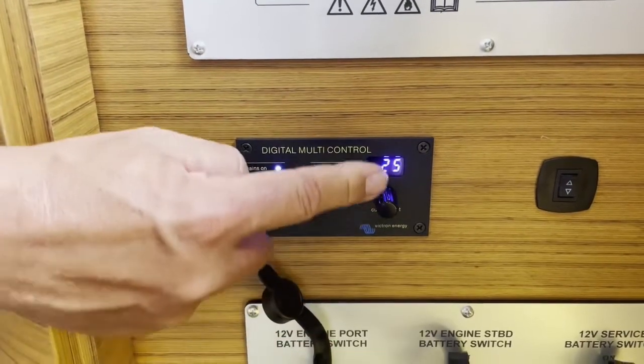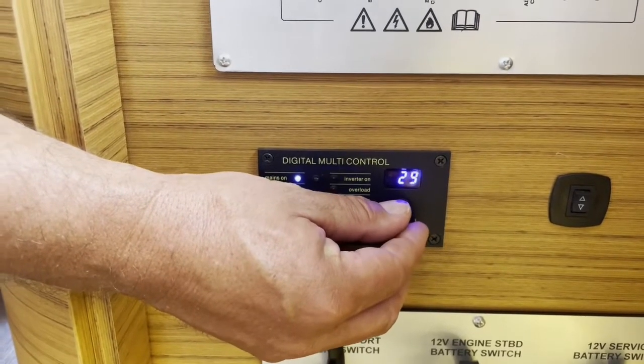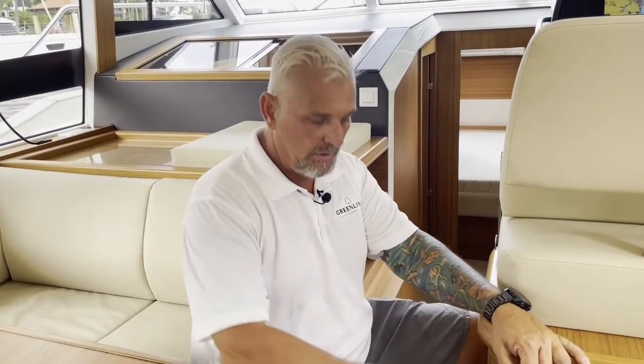This 25 is your dial where you can dial down to 19, 20, all the way up to 50 amp. If you have a 30 amp plug, you put a pigtail on your 50 and you can dial down so the boat will not blow the breaker. You can operate your boat off a 30 — you can even go down to a 110/20 — and never draw more out of shore power than the shore power can support. If you only have 20 or 30 available, or an old 50 breaker that usually blows around 45–48 amps, you can dial it down and keep your breaker and still operate your whole boat.